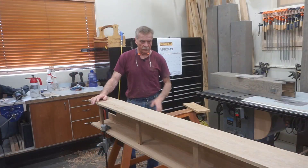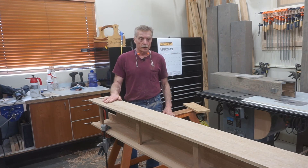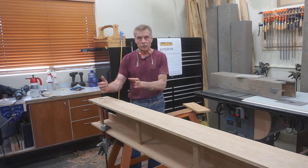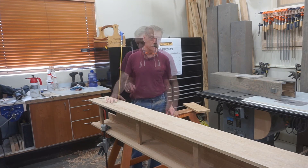Going handheld and close up, you can see what the surface looks like after the wire brushing process — it's dulled down with a lot of contour. If you get right down on the surface you can see the contour created by the plane, the spokeshave, and the fishtail gouge, but it's aged out with that wire wheel. That covers most of what I wanted to say about the weathering process — the two sizes of tools, the grinders, and primarily about spritzing with water on a hard wood to make the process go really efficiently.